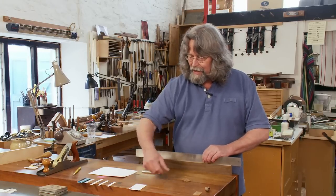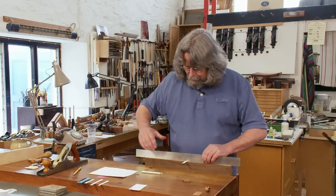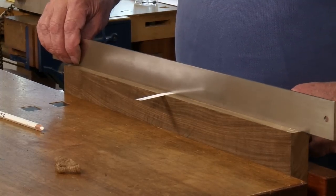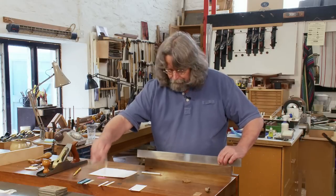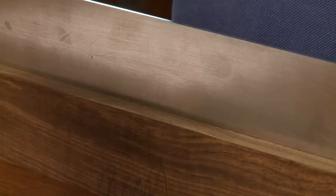It's nothing like 12 thou. Might it be 4 thou? The straight edge is on the point of spinning on the paper. So this hollow is nearly 4 thousandths of an inch. If I put 2 thou underneath, it pulls straight out.